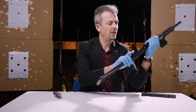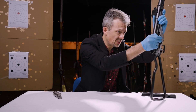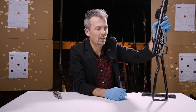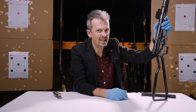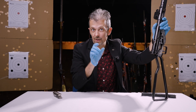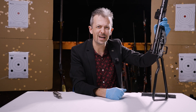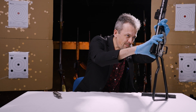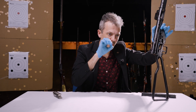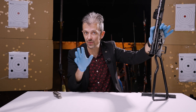On automatic, the bolt is held up on what's called a sear — you can see that through this hole here. A little sidebar: 'sear' is a very old English word, literally old English, meaning ploughshare, spelled S-C-E-A-R originally, up to the 19th century. In a flintlock it was shaped like a little ploughshare. It no longer is, but it does the same job. So the bolt is held back on that sear, ready to fly forward, pick up a round, fire it, and then blow back to that position. That's why we call this system blowback.